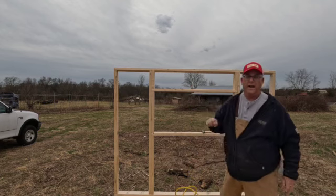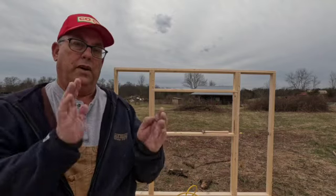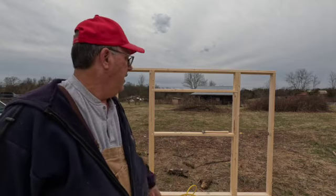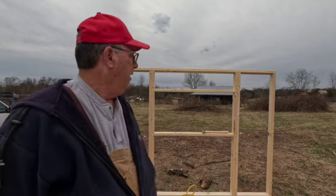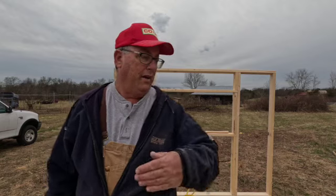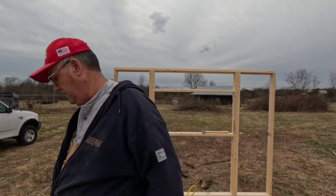You also notice that when I'm going side by side like that, like a 2x4 into a 2x4, I angle my nail gun so the nail won't go through. Because really I shouldn't even be using a hammer, because this is all finished, because we're going to paint all this. If you were building a house, you'd put walls on the inside and everything, it wouldn't matter. But now this will all be painted.